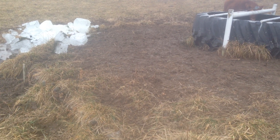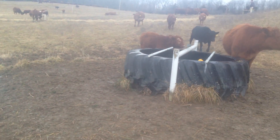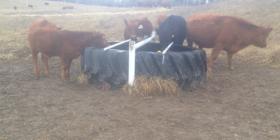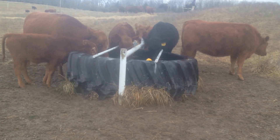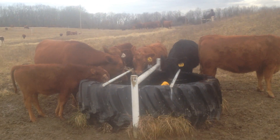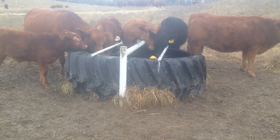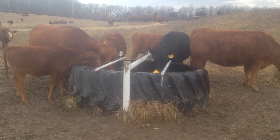You can see the big chunks of ice — we just came to this tank two days ago. This tire tank actually saw minus 25 below zero. The key here in Missouri: don't drain them. Leave the water in them, let them freeze up. When you come to it, chop the float out first — there's a float up there. We chop that float out, get those ice chunks out, and it never freezes again the whole time you use it. That water is in there to protect the valve and the water line coming in the bottom of the tire.